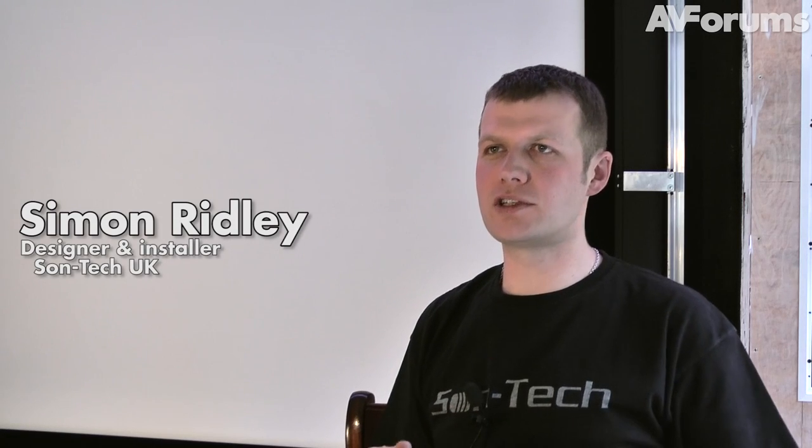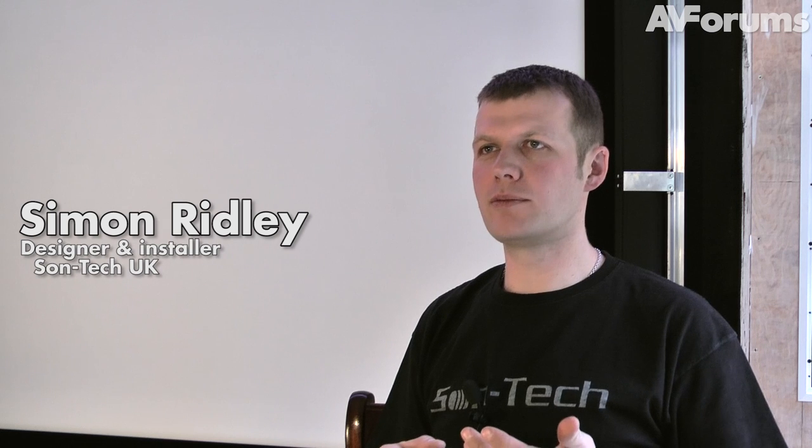Well, quite early in the design process, it was obviously wanted as a family room, and we wanted to make sure that that wasn't just a normal white light. We wanted to do something that was a little bit fun as well. So we talked about having colour change LEDs within the room, and actually we've made that the primary focus for all the lighting in the room. So actually all the lighting is colour changing RGB lighting. Obviously it still allows us to have it as white lighting as well, because if we mix all three colours, it will create the white light.